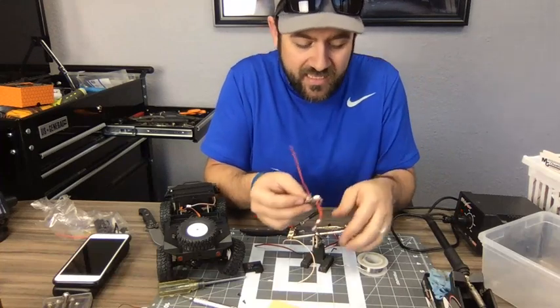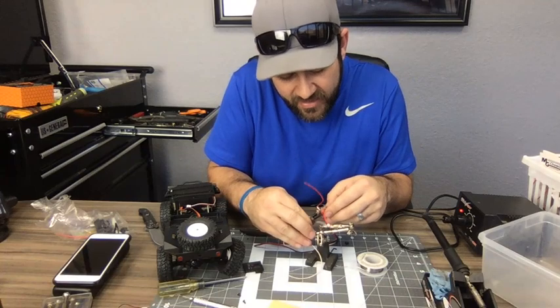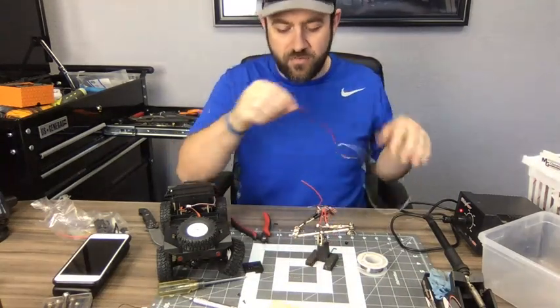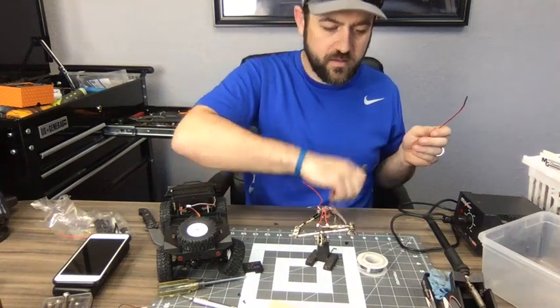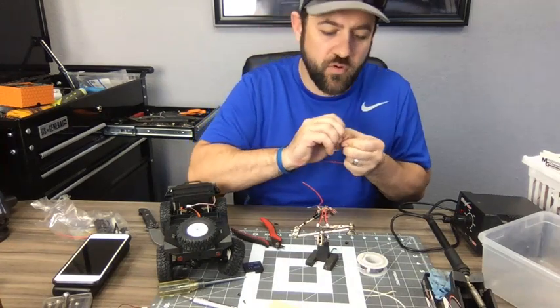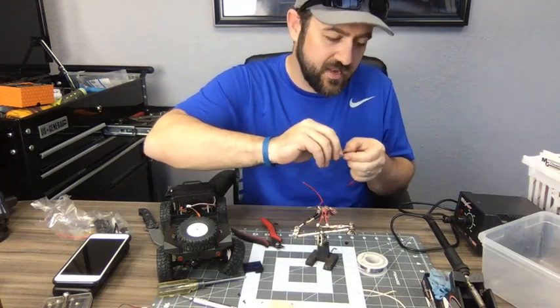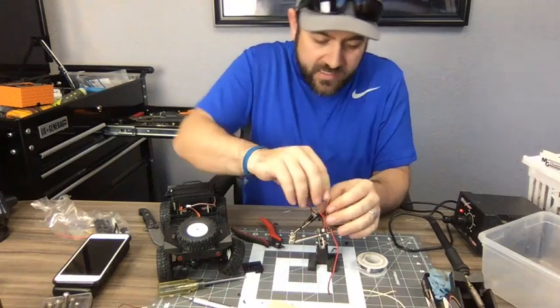These wires had insulation on them, and I just took it off so that I could get to them to solder, but then I just stopped paying attention to what I was doing, so I didn't know which was which. But I just looked at the little traces on the board and followed them to things that had wire on them still that I could tell what they were.